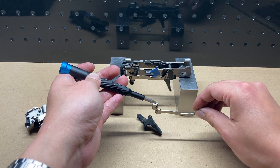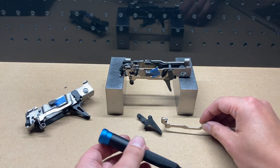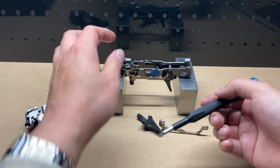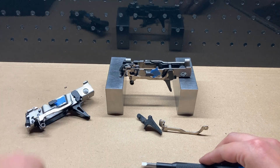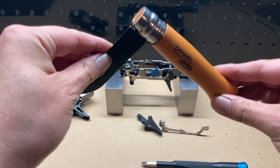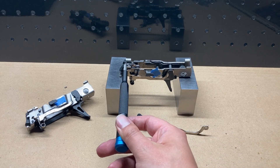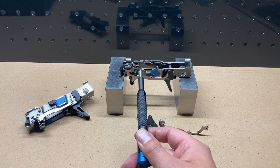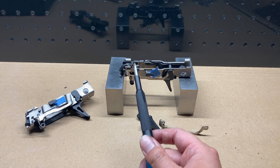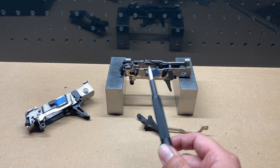It pushes on the back of the trigger bar, pushing it forwards. When the trigger bar moves forwards, it acts upon the safety lever, this little thing right here. The safety lever has a kind of downwards V — an upside-down V sort of arrangement. That'll be important later. The manner in which the sear, trigger bar, and safety lever interact seems to correlate strongly with whether an FCU fails or does not fail the full sear movement test.